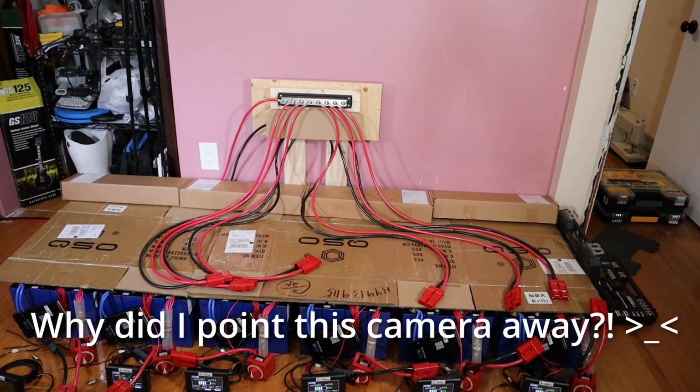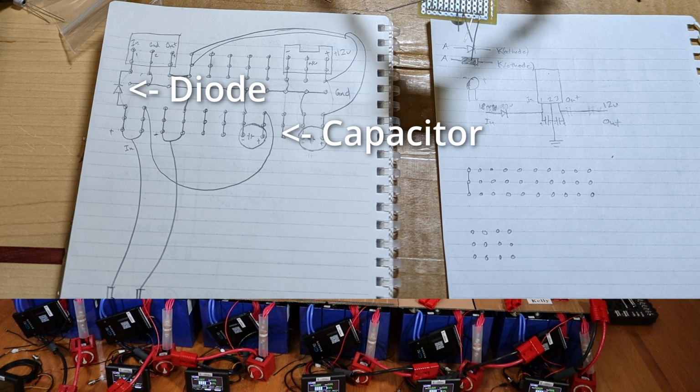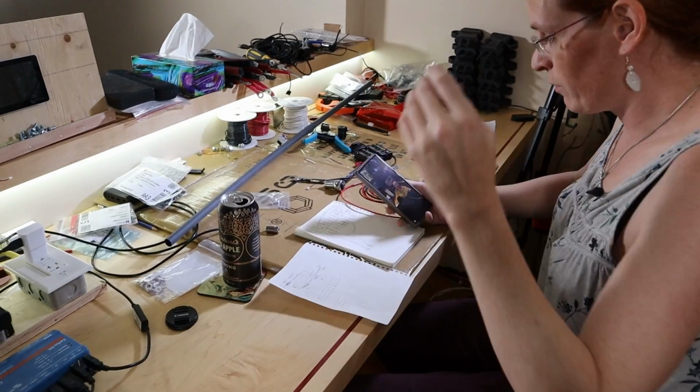So where's the capacitor in relation to the diode? Parallel. The capacitor is connected to the input, not after the diode. No, the capacitor needs to be after the diode. The original sketch you made for me was correct, because I checked it before. You had made a little schematic. In this situation... I see the difference.